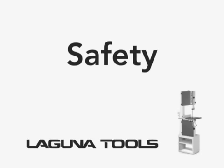Here's a few tips and techniques for getting the most out of your bandsaw. Now that we have set up your bandsaw, let's make some sawdust. The first thing that we're going to need to think about is safety. Before you operate your saw, you need to disconnect the power cord from the wall and check your blade tension. Check the blade tracking, being careful not to catch your finger behind the wheel. Now make sure your doors are locked.